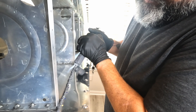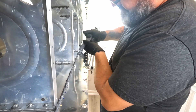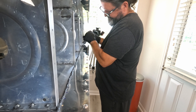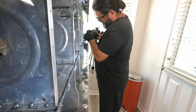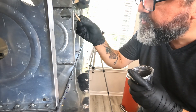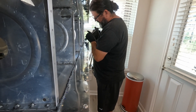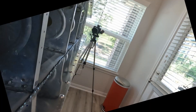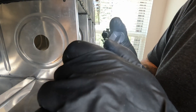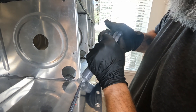From this angle that looks like a pretty good squeeze-out, and it also looks like it goes really quickly, but this is sped up many times. That's really viscous stuff coming out of a syringe — I think the opening is on the order of maybe a sixteenth of an inch — and what I'm trying to get is about a three-sixteenths bead, which I think I did successfully. I'm applying a small amount of sealant to the upper and lower rivet holes on the rib flanges — the ones that will not be mated up to a Z-bracket on the other side. Got her all flipped over and doing the same thing.